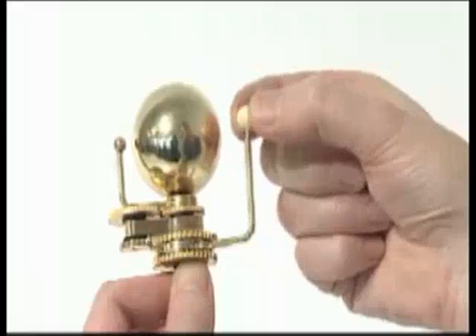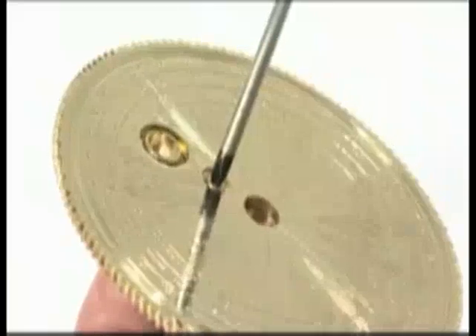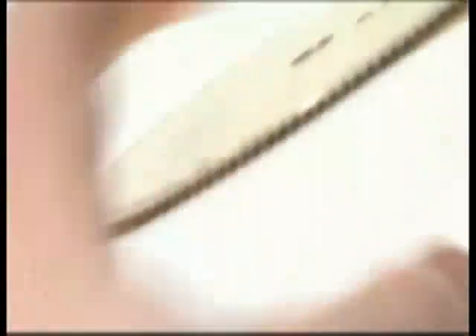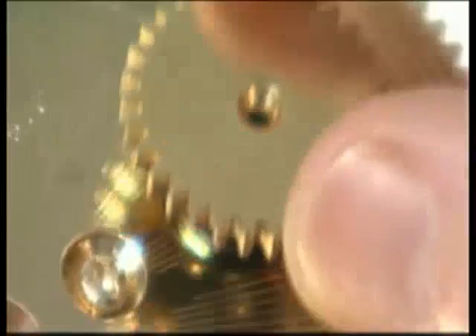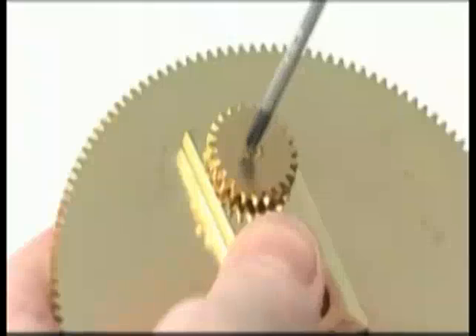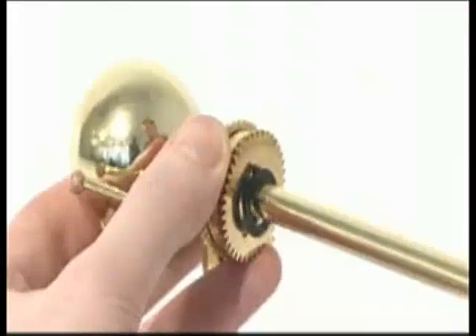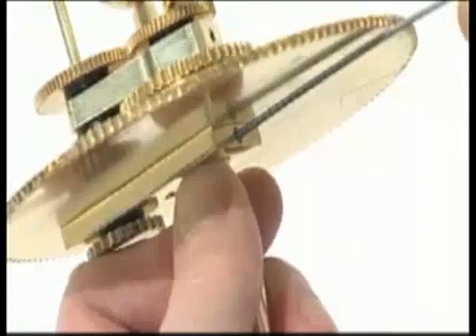Insert the planet Venus into its pin hole in the top of the arm. Fix the moon gear arm to the underside of the large engraved gear using a flathead PM3 screw, ensuring the two holes line up. Assemble the moon gear set by clipping the outsized gear axles together from either side of the engraved gear — the larger gear axle goes on top. Locate the 31-tooth gear over the top gear axle and the 23-tooth gear over the bottom gear axle. Fix the 31-tooth gear with a 6mm M2.3S screw and the 23-tooth gear with a longer 8mm M2.3S screw. Slide another plastic washer onto the central column, then slide the assembled moon gear set and engraved gear up the shaft and fix with an M3G grub screw. Refix the central column to the column support and tighten the large grub screw.